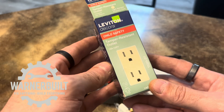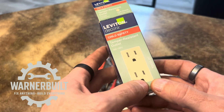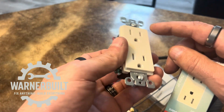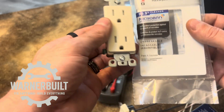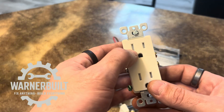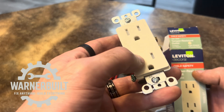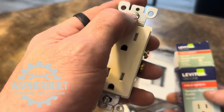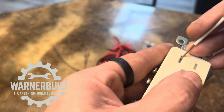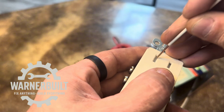This is your typical residential 15 amp receptacle. This is a Leviton in a Decora shape. Decora means that it looks like a GFI — it's got that square surface for a square opening. This one is a tamper resistant rating; it says TR stamped on it. It has blades right here that help prevent little kids from sticking things in there.